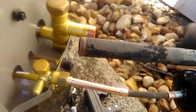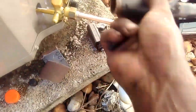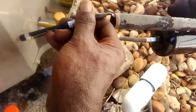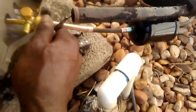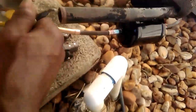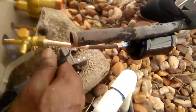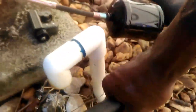Now we've shortened our pipe where we needed it so we can fit it in place. Our next step after cutting is to use our deburring tool and make sure we don't have any burrs or any trash that can get inside the refrigerant cycle and cause problems — like little metal shavings getting inside the compressor. We'll take our deburring tool and go around that inner lip a couple times to knock off any loose metal.